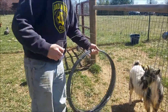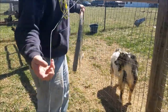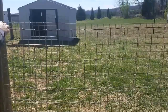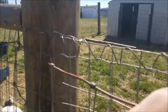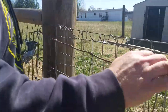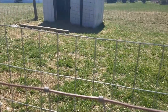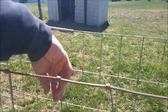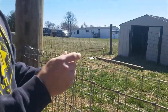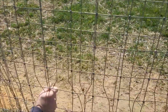We have a big spool of high tensile wire here. This is a good lesson for always keeping it in one secure place and not letting it fall over, because then it gets tangled. We're going to measure out a piece that will work from the very first t-post, and then, as you can see in this section, we're just going to weave it all across the top, stitching it in just like you're sewing. I've cut four strips of high tensile wire and we're going to stitch across — one at the top, one at the bottom, and two in the middle — going right across this section to really pull it in tight.